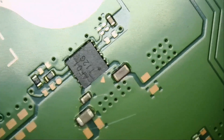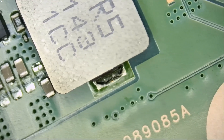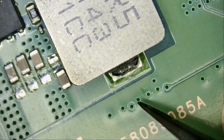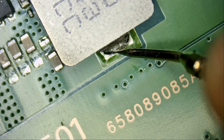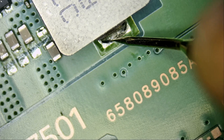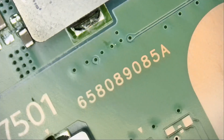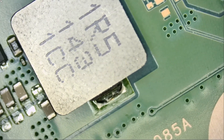I do not know exactly what that line on the chip is, but usually — I've done it more than a couple of times — the short was this tiny cap on the back. I'm going to inject voltage at the coil because the area on the front is small and the probe would slip. If I point the probe at the coil it will be more secure. And look — we have a short here. Zero voltage drop short. Zero ohm short. Let's go ahead and inject voltage at the coil and flip the board to see where the heat is coming from.